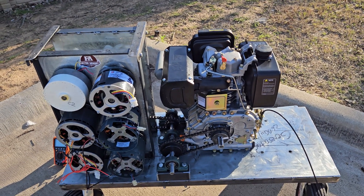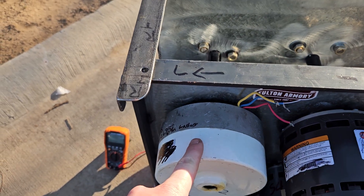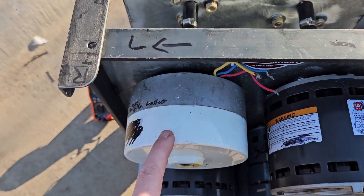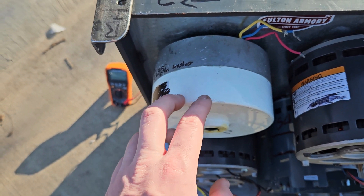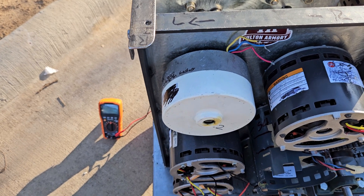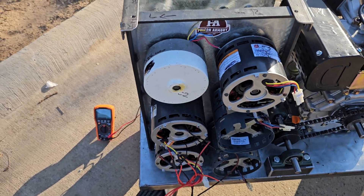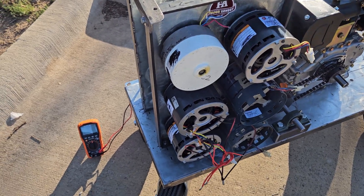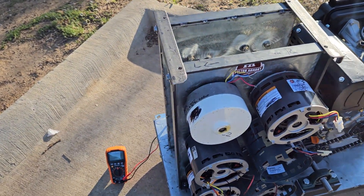The next videos will be wiring and bringing all the wires out. I might switch these ECMs out — I have plenty of them — and use the ones I swap out for something else. These potted motors would actually make a really good wind or water generator because they're fully potted: you can't modify them, can't see the coils, only the leads coming out and a bit of steel with the magnets inside. So this is essentially waterproof — great for a water wheel. It's a 120-volt motor so with a good water wheel you'd get solid voltage. At about six amps that's decent; if you had four or five of these as water wheels you could run a small cabin.